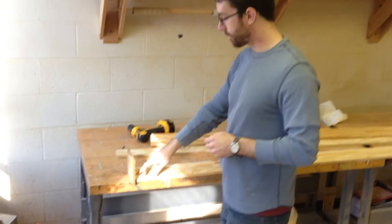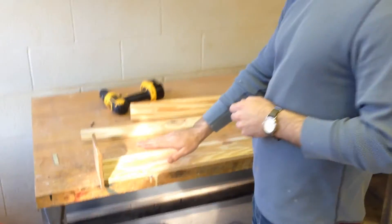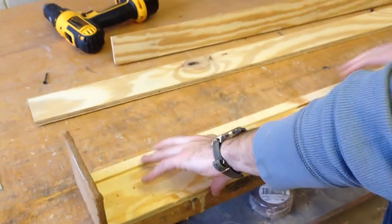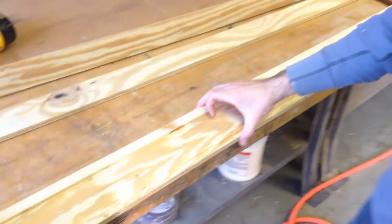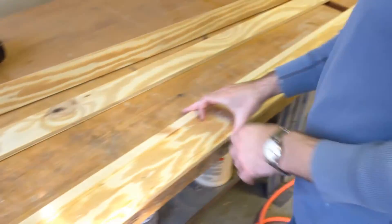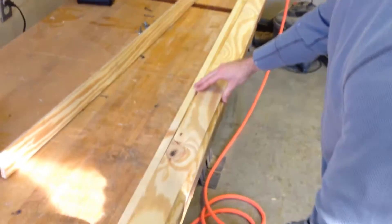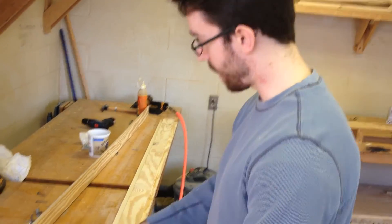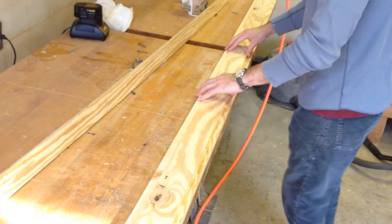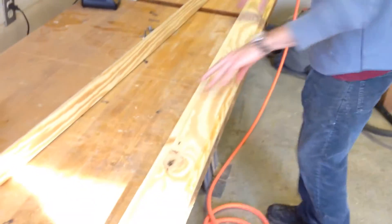All we've got here is Mike's jig, handmade. This is basically a guide that we put our two pieces of wood in so that we know they're nice and straight when we glue and nail them together. This guide is nailed to the table so we know it's not going anywhere. You take your straight piece and bump it up against both edges of the guide, the left and the front piece. Then we're going to take small screws and screw this down so even if this piece of wood is slightly warped, it's going to be perfectly straight because we've got that guide to go against.